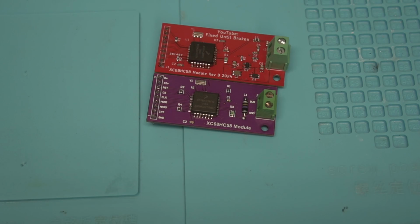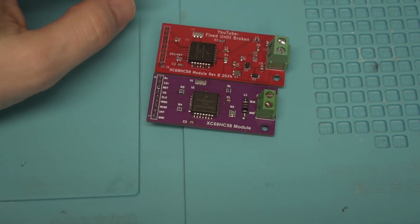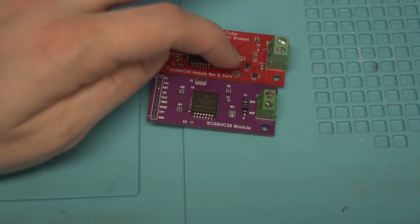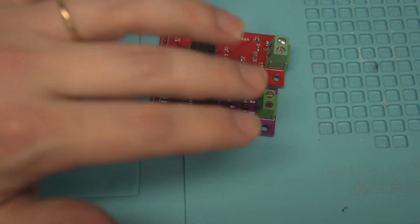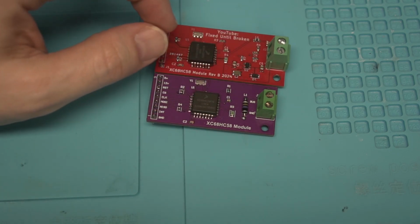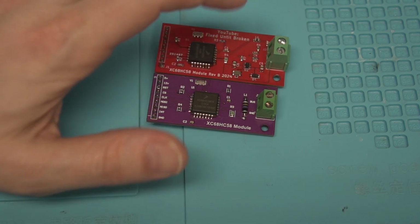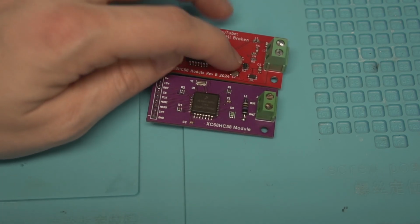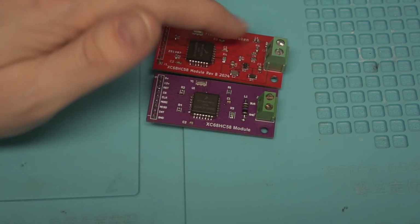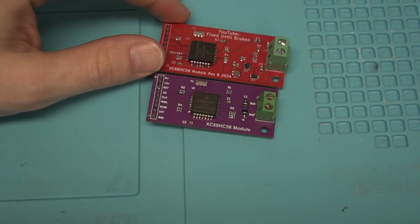And then, yeah, so the big difference in the two is this boost converter here. So we take that 5 volts and boost it up. It can support up to 200 milliamps. However, this IC's max current it'll pull is 50, so we have a significant margin there. But yeah, we just have an inductor, a switch mode IC that has the built-in FET, and then diode, and the supporting infrastructure that goes along with your boost.